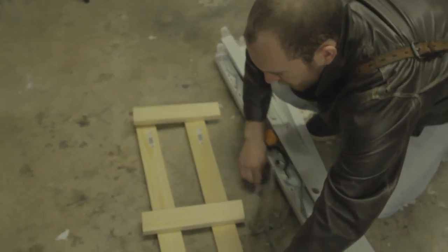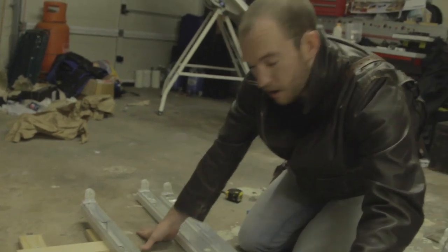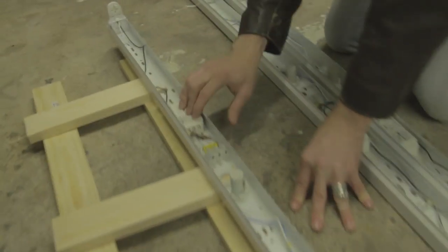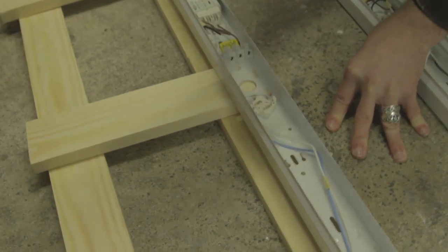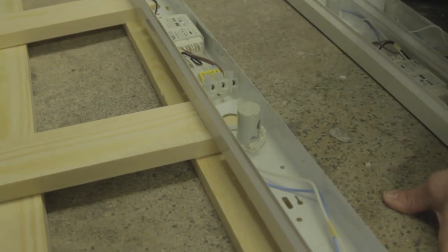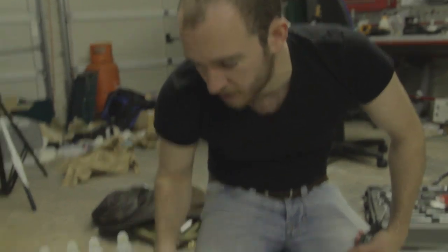Three one-foot-long pieces of wood. As you break the light apart, you've got different components. Obviously we've got power cables running the length and we've got the sockets that the bulb itself sits in. The large element here — this is the ballast. This is where the power goes in and then gets regulated out to the bulb, and this is the starter. This comes out, it's replaceable. These go after a while and they take a while to fire up, but you can access that through the cover here. They're very, very easy to replace. The ballast not so much, but as they age — as you can hear, you can probably hear a nasty buzzing sound. That's actually the six-footer up there. Because we've got quite fat screws going into this wood, so we don't split the wood, we're just going to stick some pilot holes in, just to clear a little bit of that wood away so we're not putting as much strain.